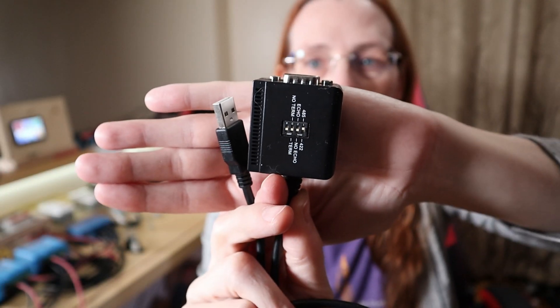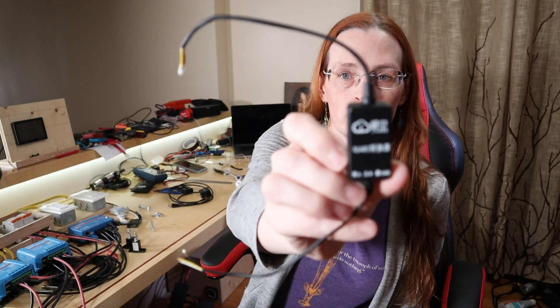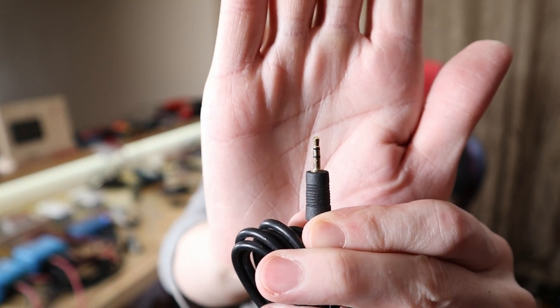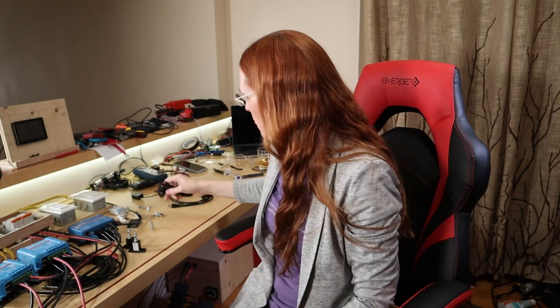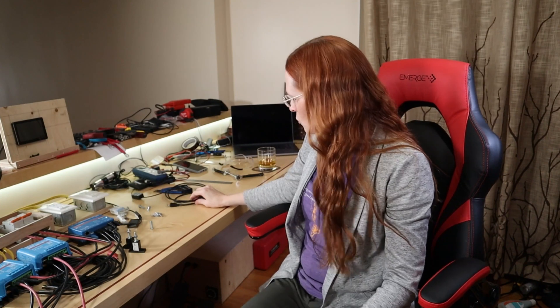I've bought an RS485-to-USB adapter using a standard DB9 connector — serial ports, if you remember those. The JKBMS has an optional RS485 adapter that I bought. I have one of these one-wire serial adapters and I'm hoping I can connect the bare wires from the JKBMS RS485 adapter onto the three pins. If they're not wired up the right way I'll just cut it open and run them in directly. Once that's done, I'm going to figure out how to talk to the JKBMS directly — thankfully they do have GitHub links describing the RS485 protocol, which I'll provide in the description below.